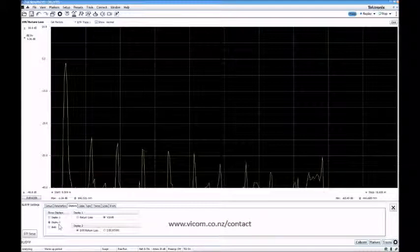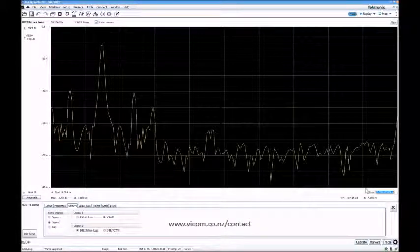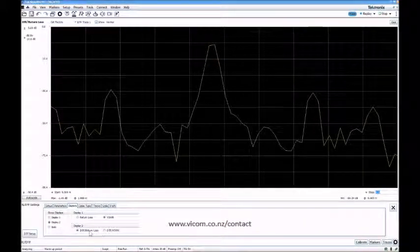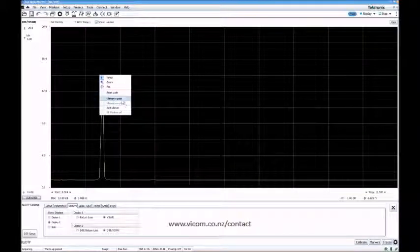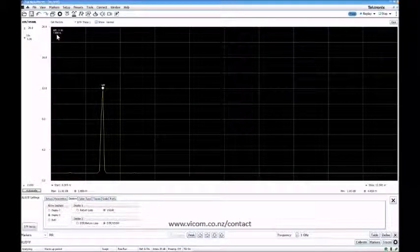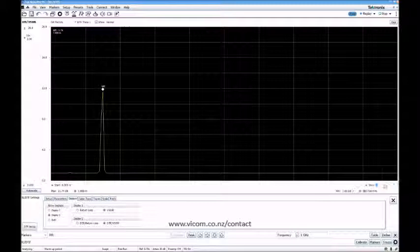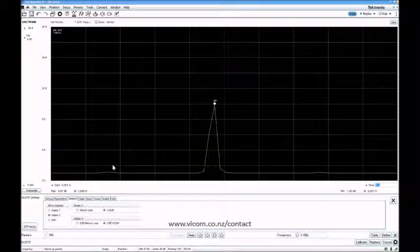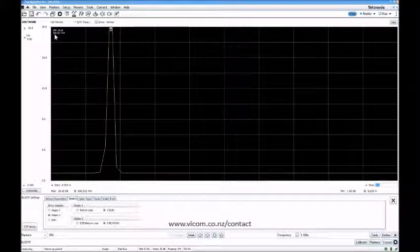You can do that either way, if I can get this working like this. So here you can see the stop and do an auto scale, and we can do the stop at maybe 4 meters because I don't have a long cable. Either you can look at it like this, or you can do it like this. And I like this a little bit better. If I auto scale this one and add marker to peak, I'm sure you can see that it's 1.889 meters, and it's probably exactly what this cable is. If I change in the middle, I have a small connector here, and I want the stop to be 4 meters. Here, you will soon see, when I move this out, that now this bad connection, I will move this. So this is the first instance of my cable, mark it to peak, and you can see that that's a 700 millimeter cable.